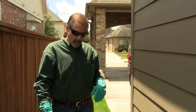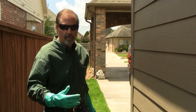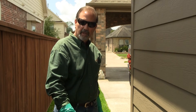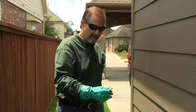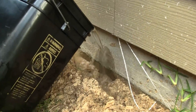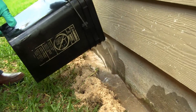So we're going to go ahead and get started here. We've got our trench dug. When I pour the product into the trench, I like to pour just a little bit above the trench area. You can let it hit that slab side and just kind of let it run down the slab and fill the trench up. Try to avoid having any product spill outside of your trenched area. We've already got everything all measured off and we're just going to pour our product all the way up to the edge.